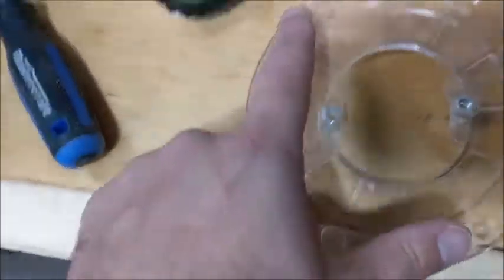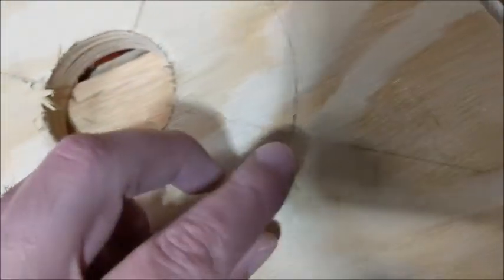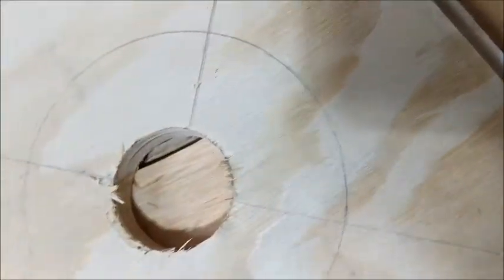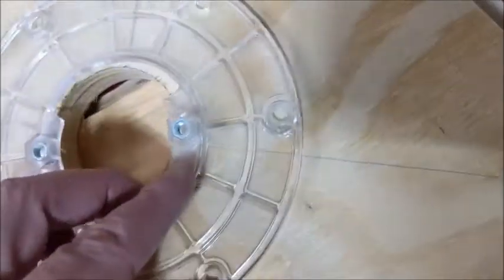And then what I'll do is I will pre-drill the holes for the router itself, where to go, and because you don't want to make it too thick, because if you look, this is your screw, that's got to screw this onto the router. Sure, you're going to countersink it so it's flush, right? But still, it's definitely not the thickness of a 3/4 inch piece of plywood. So I'm going to router out the inside here, so this plate, or not even this plate, but the router itself can slide inside here, and then we'll screw it in from the top side onto here.